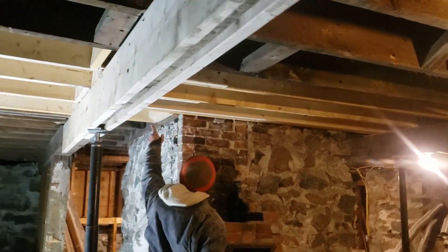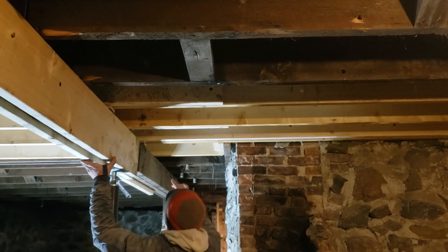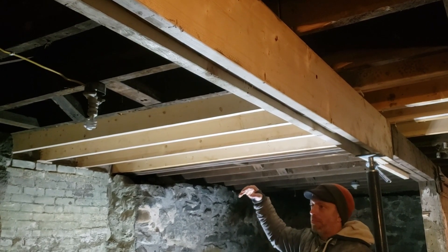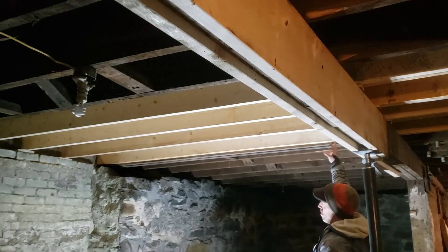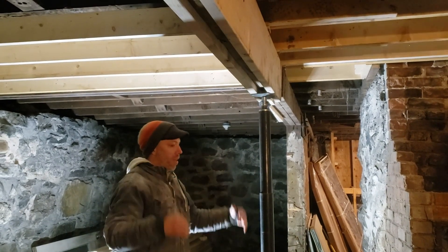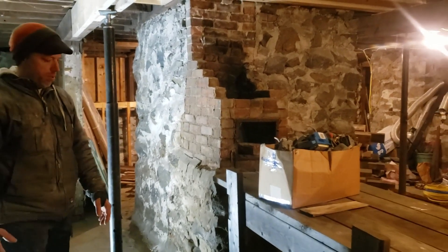So as you can see, this is the girder that I put in that we're going to land the post onto. Here's some of the floor joists that were damaged by the smoke. This joist and this one were both damaged to the point of being charred from the fire damage, and one of these were charred as well. So I went ahead and replaced all of these because they had smoke damage and they're a little saggy. They were also cut — at one point someone had big chunks missing from them. This one was in three different pieces. So I went ahead and replaced those while we were here. Now we've got the temporary post in, and as we continue to level the floor and get everything situated, we'll get those out. I'm guessing this was coal storage here — it was all framed out, so we removed all that and opened it up and cleaned it up.